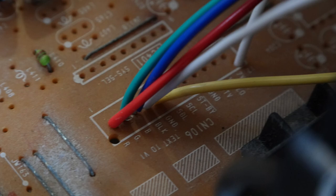I've come across a lot of people who do the BG1S and BG2S chassis. I see a lot of comments — and I was guilty of this right at the beginning too — where they see the RGB inputs on the board itself and think: beauty, I'll just plug straight into that, put my blanking in, not really research anything else, and just see how it goes. They turn it on, get an RGB picture, and think it must work and must be all good.